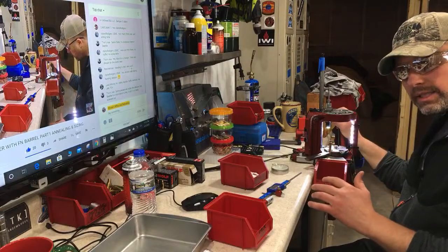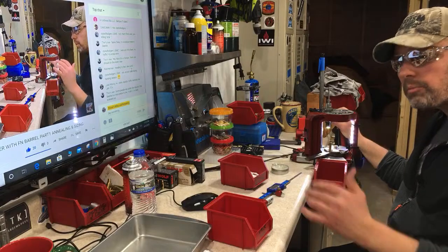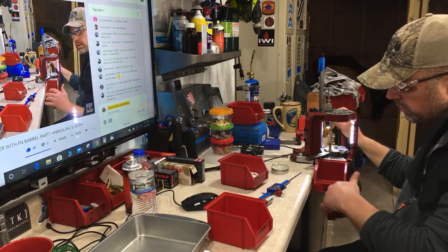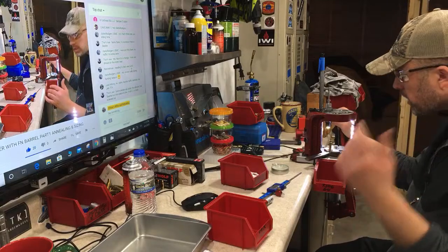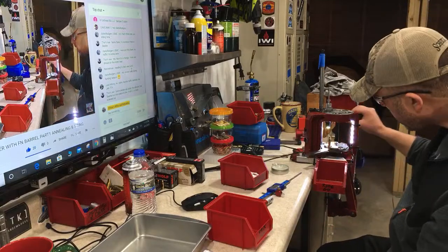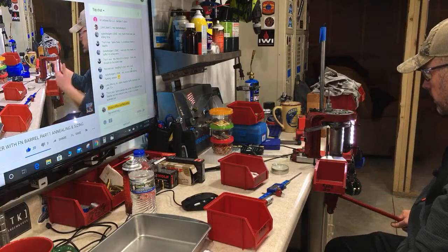But once I get past that, and I fire this once in my chamber, I only have to bump it back 3/1000ths of an inch. I don't measure it like that. I might measure the first 5 pieces, and then I just give her hell. But at least in this situation, I got to. So this is gonna go in.